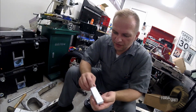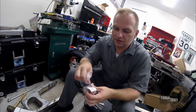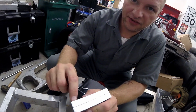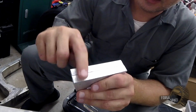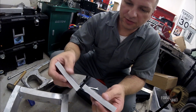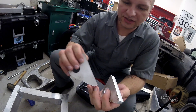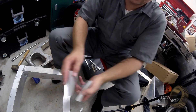All right, so this is for the rear swing arm. I ordered these laser cut, and we'll see once the other brackets come in if it's worth getting it laser cut or if I want to just make sure it's all machined every single time. You can see on this side how smooth it is, but as it goes down in the laser as it's cutting the thicker material it kind of tears away at the material. It's going to be good for what we're going to be doing with it, but I think getting it machined might actually be better next time, just because it'll leave a cleaner surface and the prices may actually end up being comparable.